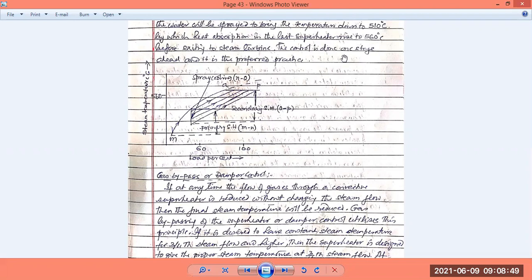The output of the power plant comes from the turbine section, which creates torque and runs the electric generator as per the requirement. The turbine should operate at a specific design torque, running from a specific temperature and pressure given to it. The specific temperature and pressure of the vapor is injected at the base of the turbine through different nozzles. This pressure and temperature must be controlled as per the design requirement of the turbine.